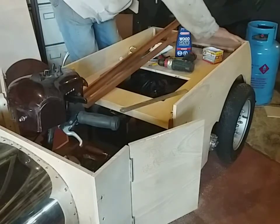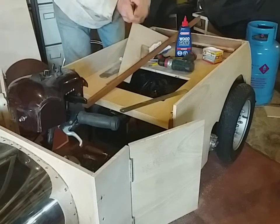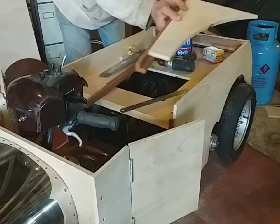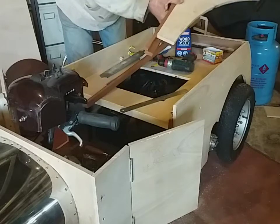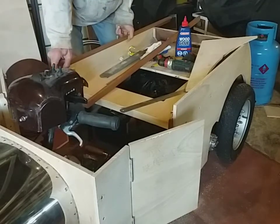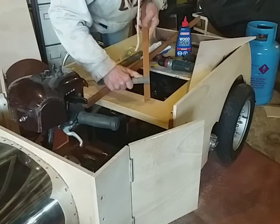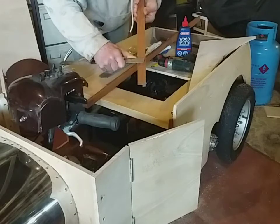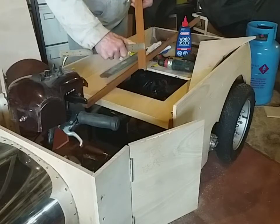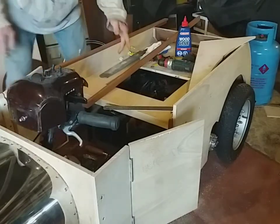The next job is I've levelled this back off and it's all glued up. I've got some mahogany and rebated it and cut it so it's exactly level with the 12mm ply, because I'm going to glue and fit it on there for the back end. The top is an inch finished and sanded, and the sides are just over an inch and an eighth — so roughly inch by inch and an eighth — rebated out so it's going to glue on there.